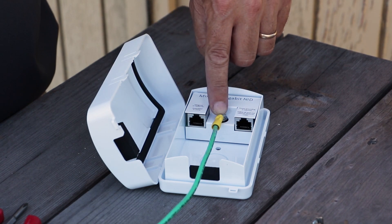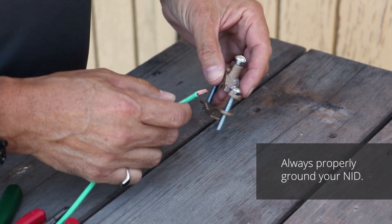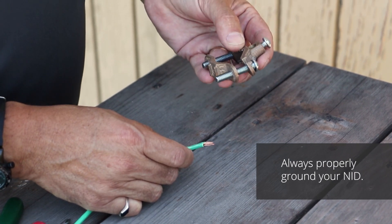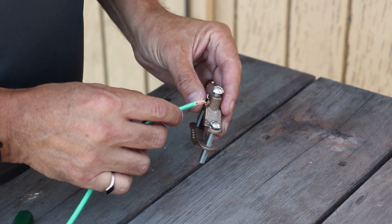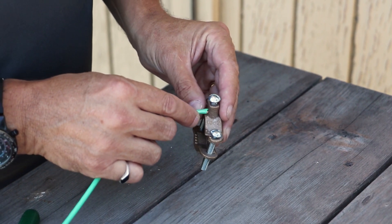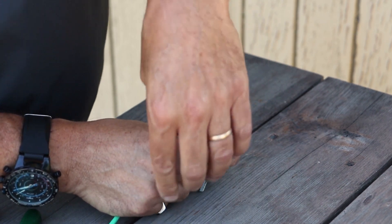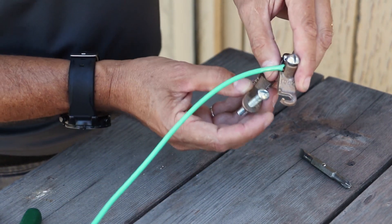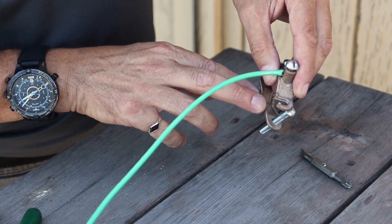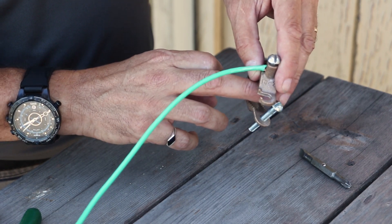I've already put a little ground wire in here as an example. With the ground wire, we'll come to this point, strip this down — number 10 wire. Here's an adjustable ground clamp; they're available in larger sizes, and this is one of the smaller pieces. Strip down, come in here, tighten this screw down with your screwdriver. This piece here is adjustable — you can even rotate or flip it if you have a small diameter pipe: EMT pipe, copper water pipe.